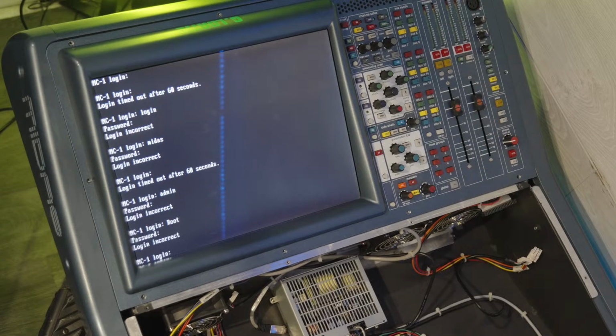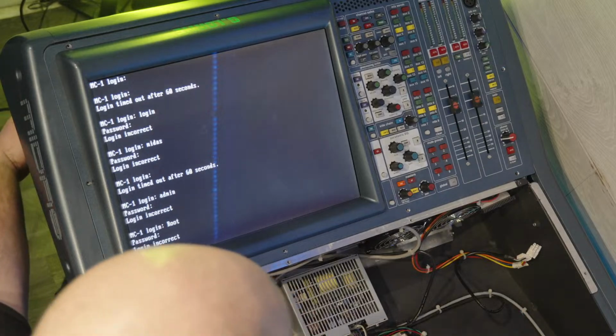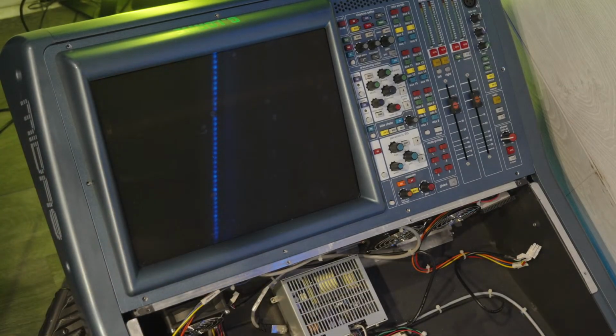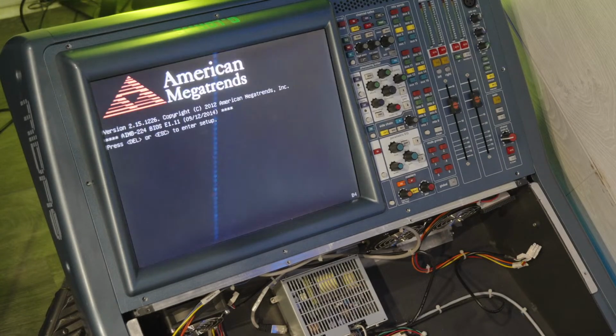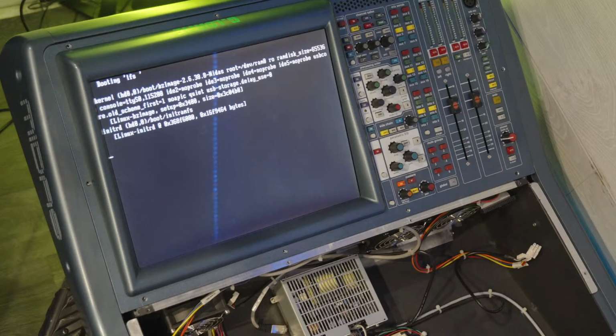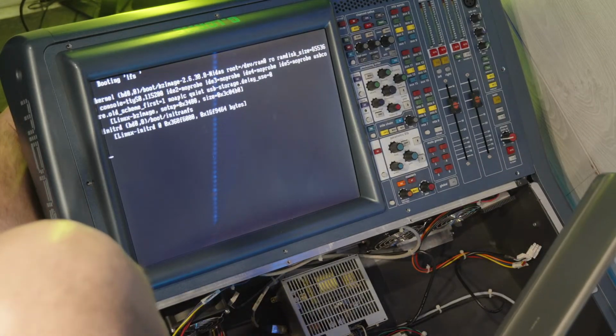I saw later that the BIOS runs the SATA as IDE emulation, so I don't expect to be able to boot from the USB drive. Maybe we can try that. We can try to reboot and change it, because this is a SATA drive. It would probably run it as IDE emulation, but I don't need to run IDE emulation. I missed the BIOS here. Hold on.